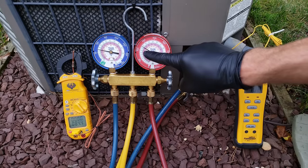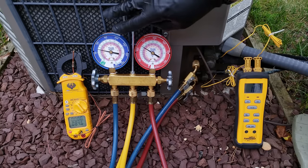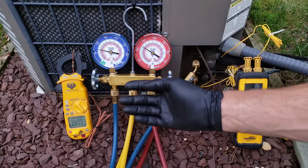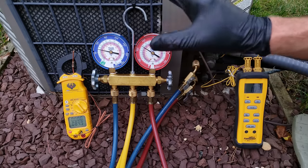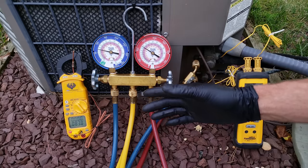If we had a saturated temperature of 125°F in the middle of the outdoor coil with an ambient of 85°F, that would mean 40 degrees over ambient — indicating the system is overcharged. That's what the Ambient Plus 30 rule tells you, but we've got to pay special attention to the vapor gauge no matter what charging method you're using.